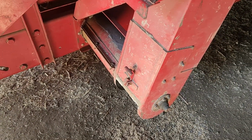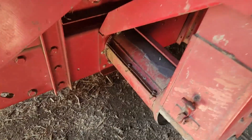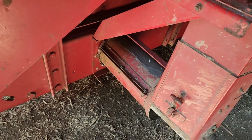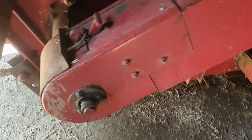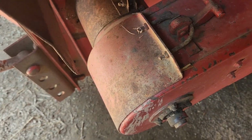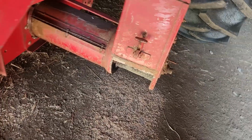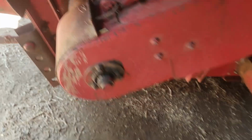which isn't too bad when you've already done wheat. You know, small grain to soybeans isn't too bad. The auger covers change out to a screened cover, so I got screen covers that go on the clean grain auger as well as the tailings auger. I also have the screen doors. Obviously, putting this moisture meter on, I'm just going to use the solid door all the time now on the clean grain elevator. And then the only door I'll have to change out is on the tailings.